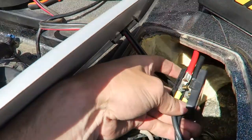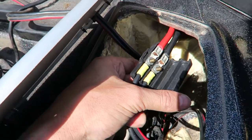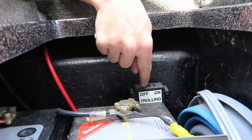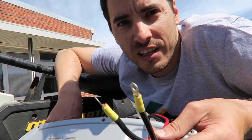One thing I love best about Ranger boats is they make things so simple for you to change. Normally to change a trolling motor I'd have to relink all those power cables from the batteries and everything. On this boat it's so simple — there's a box underneath here, you open it up, you take the two lugs, you swap them over and you're done. Pretty straightforward. You reach in, get the cable, open it up, change them out and you've got your next trolling motor on there. That's one for any local boat builders — the unique little things that count. I'm going to the back of the boat to make sure the power is off. Ranger boats making things so simple — I can open up the hatch, see that it's on or off. In this case it's off, so all my power is isolated to the front of that trolling motor. Trolling motor is disconnected. Not even a minute.